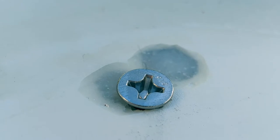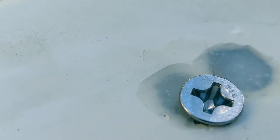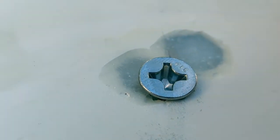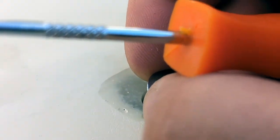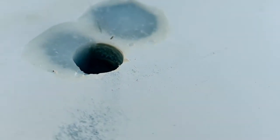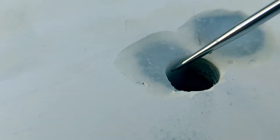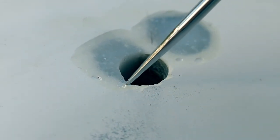Once that's in there, if any moisture or water should leak around the bolt, and it will, it's a boat, and then things flex and move and expand and contract with heat and cold, the water won't penetrate the epoxy at all, but it will penetrate the wood. So if you see how this is all drilled out, you have a nice wall of epoxy there all the way up and down the hole, and that's what we want to see all the way around the hole.